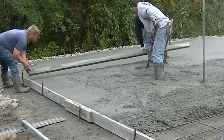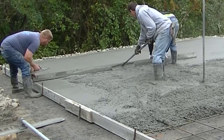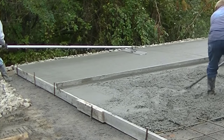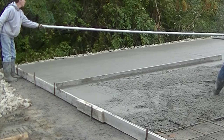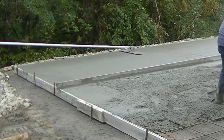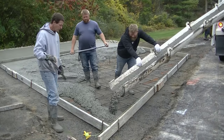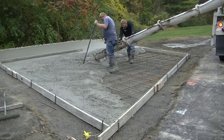The raker's job - you can see how important it is to have a raker. There's always something to pull back or fill in; it's never really perfect. So the raker is really important and it helps speed up the process a lot. Once we get the concrete all screeded, we'll just run the bull float over it to smooth it out. It pushes down the aggregate and brings up some of the paste and cream to the surface, which just makes the whole job a lot easier to finish in about an hour or two. With the bull float, you push it across making sure the front edge is tipped up, and when you pull it back you make sure the back edge is tipped up - go nice and slow.